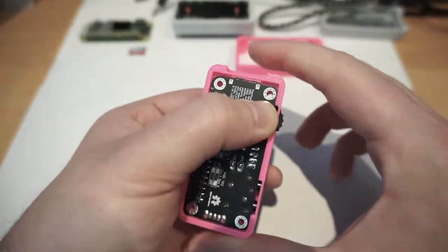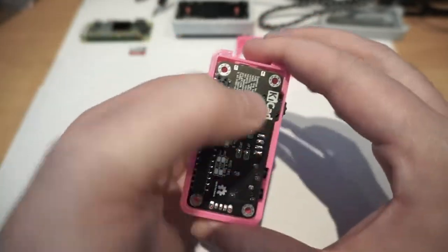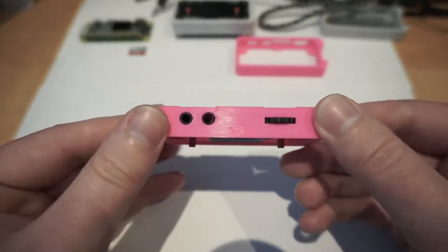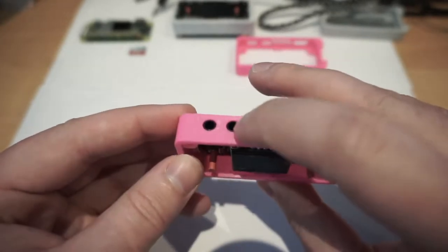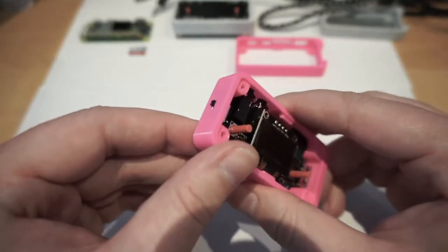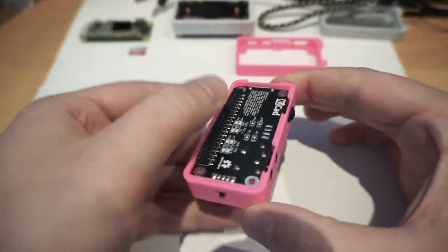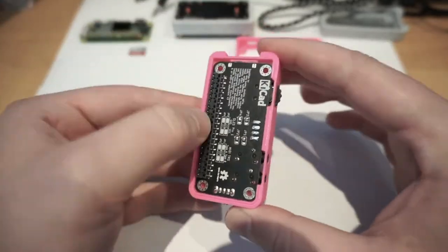It makes a horrible crunching sound — that's just the PCB slipping past the edge of the case, you're not actually damaging anything. As long as you keep that grip on the wheel, everything's going to be good. As you can see, everything is now seated nicely: the wheel is poking through the slot, the jacks are poking through the case, the wheel moves freely and is not obstructed, and the switch is in position and works. That's all there is to it. Always work on the power switch edge first, then shift everything around while pinching the wheel, and everything will be okay.